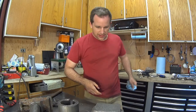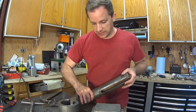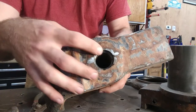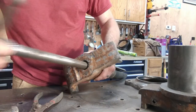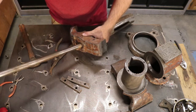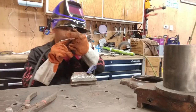So that's just about everything cleaned, and most of it we're going to put a nice coat of paint on. Some of the spots we're going to oil, like the shaft here, so that it stays rust-free. The play that we're fighting with is this right here — you can see it's actually got a little bit of a ledge. What I believe has happened is wear from the shaft chewed up slowly into there and wore it out. Something you can do to fix it is get a washer that happens to fit right into that hole, or fill it with weld.